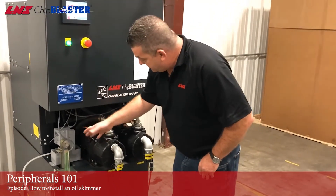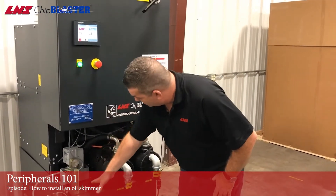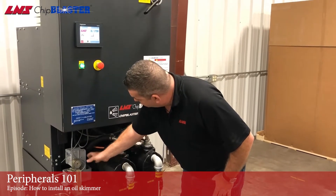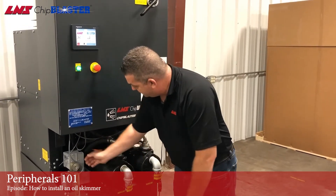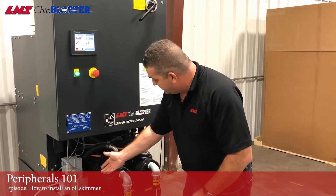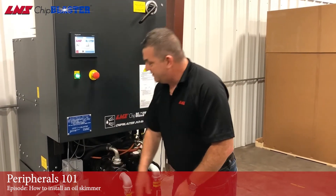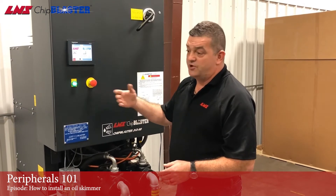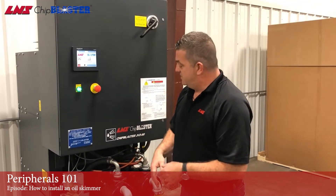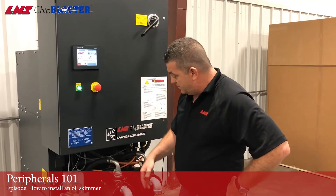The PLC will know what to do with the skimmer. Don't freak out: when the chip blaster sits and they're not calling for high pressure, the timer starts. The reason it does is because we want the oil to settle before the skimmer starts working. The pumps will turn on to get it to overflow over the baffle, so all the nasty oil comes up to the front to let the belt do its job more efficiently. It'll do this cycle two times. And if you call for high pressure constantly, the skimmer is never going to turn on — so let it sit for a while and it'll take care of business.